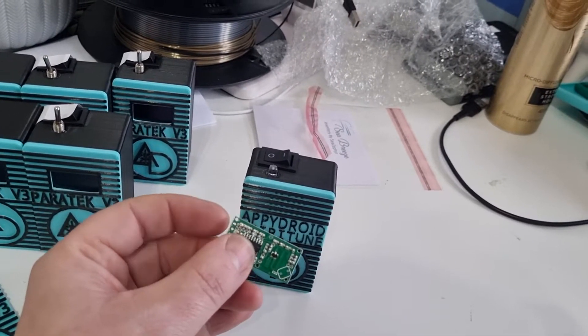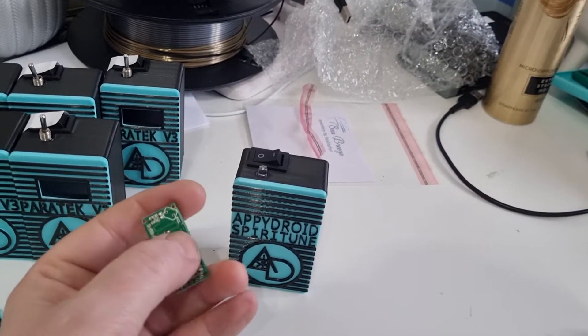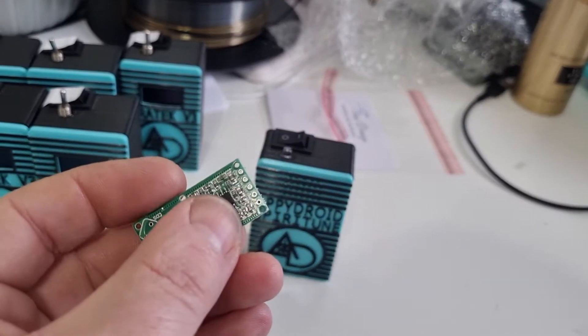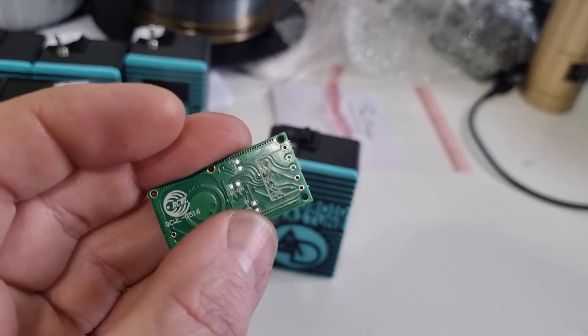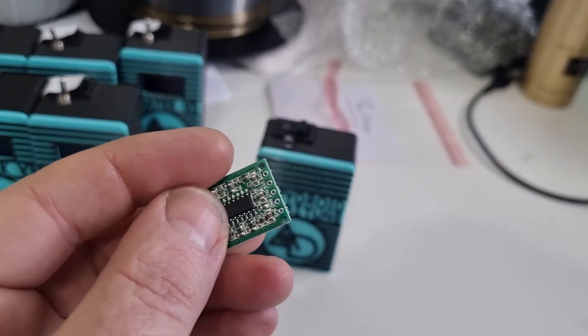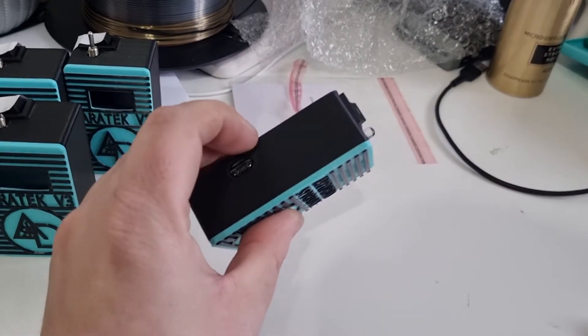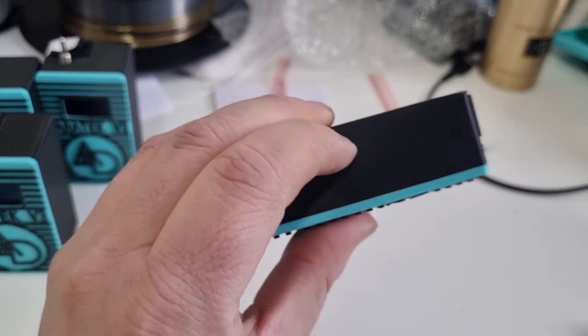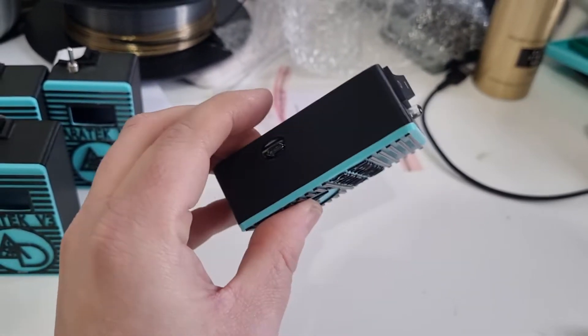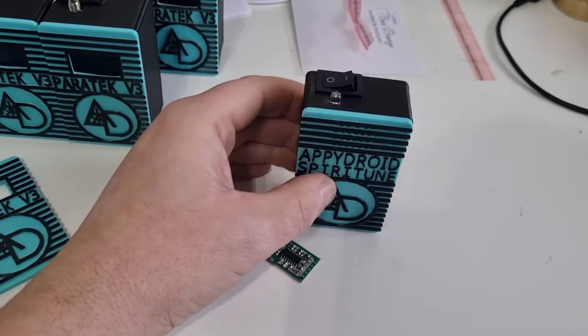It will use the pinout — you can either connect these to a relay and power lights with them, which is kind of the intended purpose. The out pin goes high when there's motion detected. That's how we can control this little music board that's in here. It has a high pin on there as well, so it detects when that's activated and triggers the device.